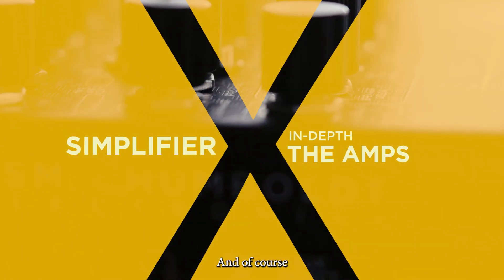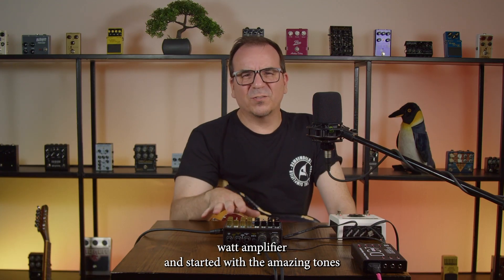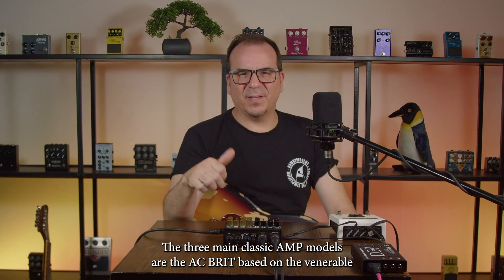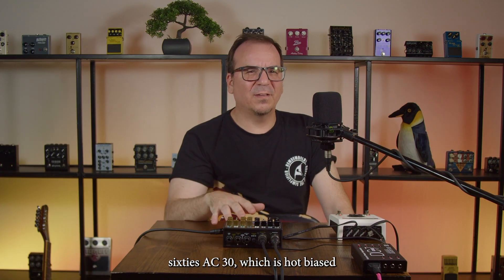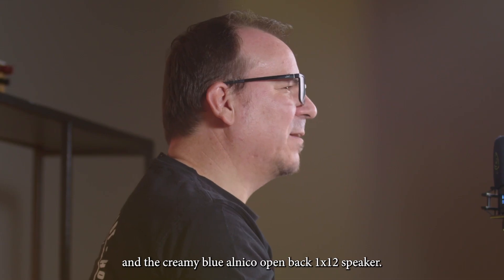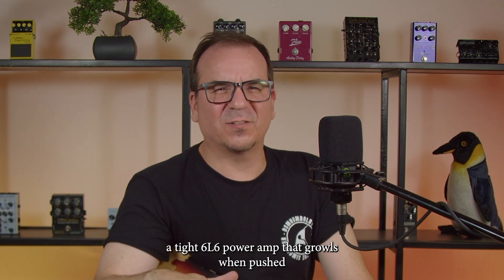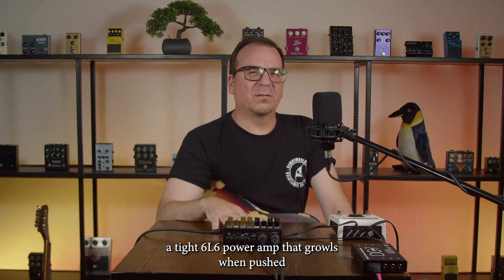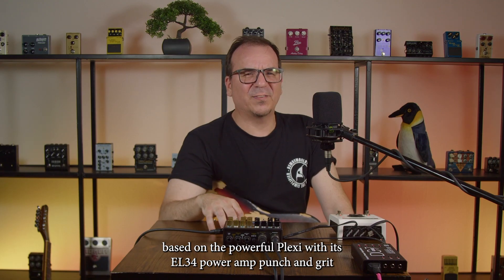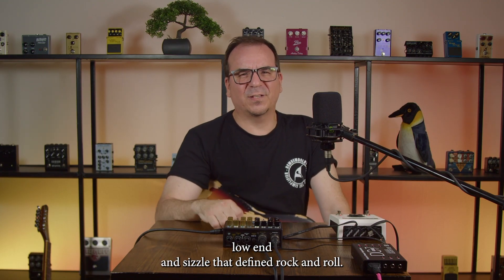And of course, the amps. We went all the way to create the ultimate analog zero-watt amplifier, starting with the amazing tones of the Simplifier MK2 materialized in channel B. The three main classic amp models are: the AC Brit, based on the venerable 60s AC30 with its hot-biased EL-84s, no-feedback power amp, and a creamy blue Alnico open-back 1x12 speaker; the USA, based on a Fender-style amp with high feedback, a tight power amp that grows when pushed, and 2x12 Eminence black speakers; and the MS Brit, based on a Marshall-style amp with EL-34 power amp punch and grit, and a 4x12 Greenback cabinet for that low-end and sizzle that defined rock and roll.